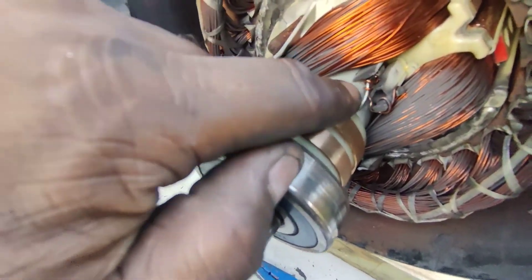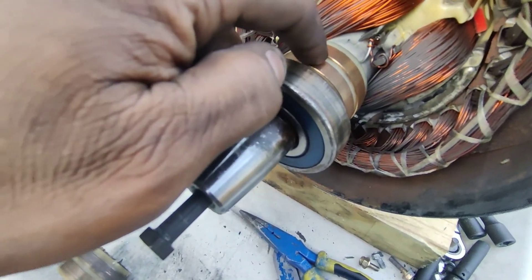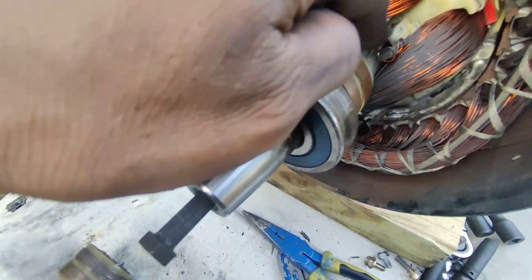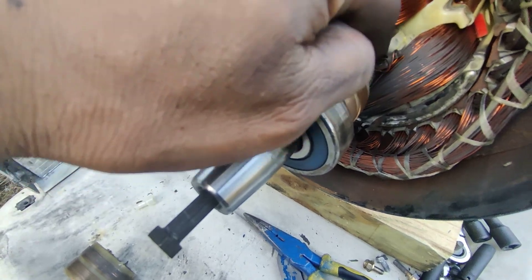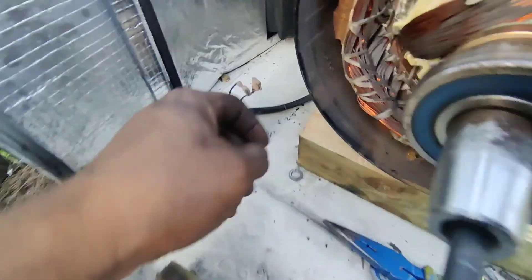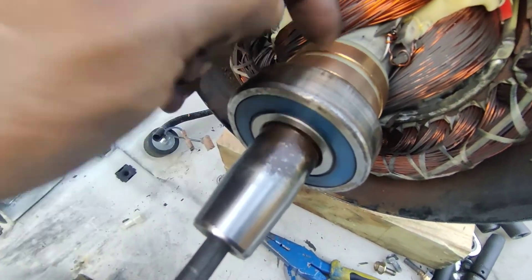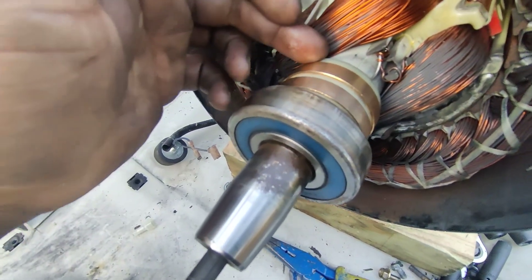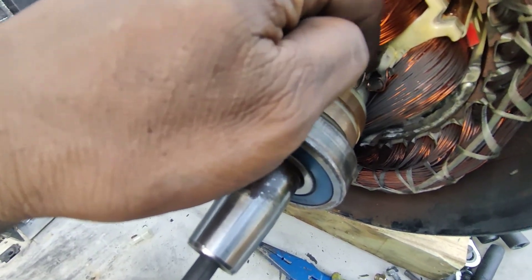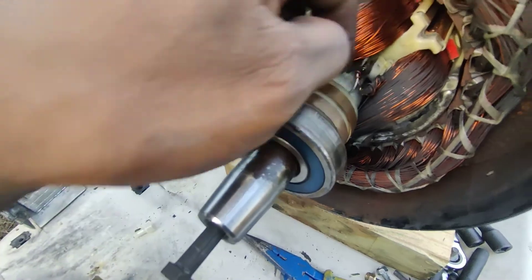You can see the slip ring connection — it's just a little crimp, just one crimp. They had it wrapped around so I just put it back like that. Before you pull the slip ring off, use your meter to see which ring goes to which wire. I've got a blue and a black wire — basically negative and positive. I wrote blue and black and marked which goes in front and which in back. Just make sure you don't mix those up and put it back the same way.